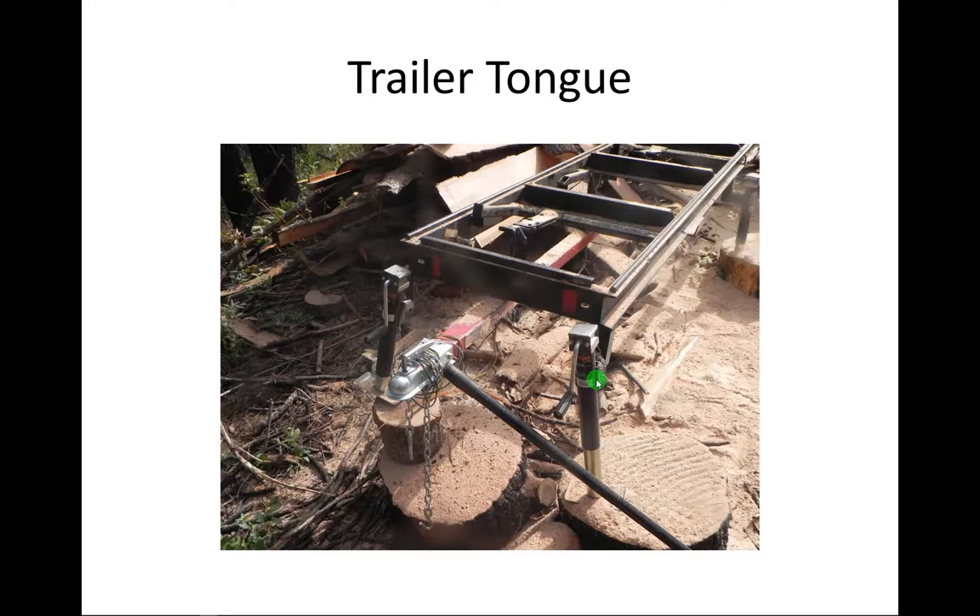There are some limitations not immediately clear from their site. When they say there's some outrageous huge amount of diameter of logs you can mill, that's not true — you can do about 20 inches, but it's sufficient. We have a small tractor, so we can't really handle really heavy logs anyway. The vice system — if you move the part that adjusts the log diameter too far, the rail will not allow it to be set. So don't expect to cut 40-inch diameter logs. But for us, it's not a big limitation, and this probably exists for all personal portable sawmills.